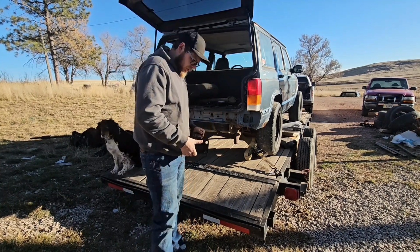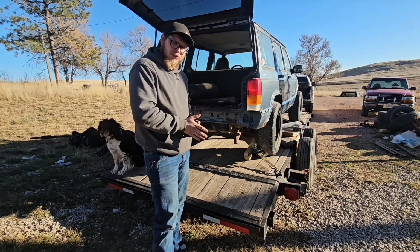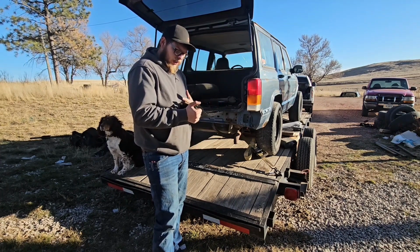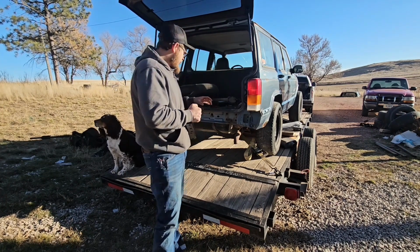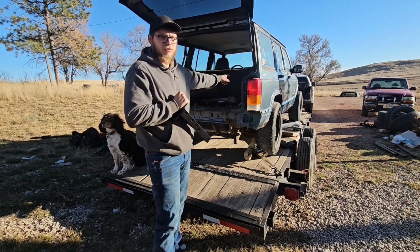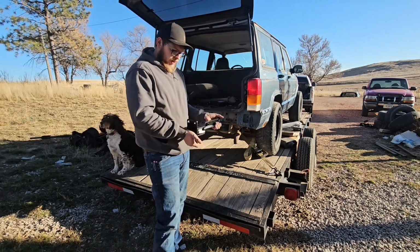I am going to cheat a little bit. I really hope you can see my face. When I do the frame stiffeners in the rear, I'm going to basically add on to them and punch through and make sure that they tie into these super stiff, so then the rear bumper is not only mounted a little over a foot in, it's mounted to the front bumper through all the frame stiffeners. So that is the plan for the day.